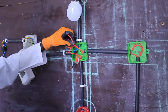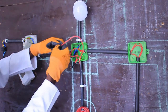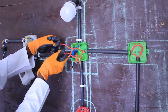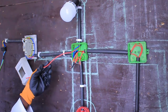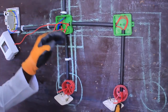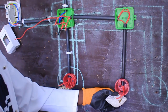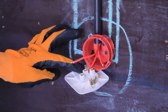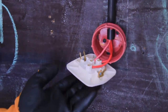What you have to do — as I already told you — in each direction there have to be three cables: ground for protection, phase, and neutral. As you can see in our junction box, there have to be three cables for each line, and you also mount the pipes accordingly. When you connect each cable to one another, you have to do it slowly. At each switch, there also have to be three cables: one for ground, and two for phase and neutral, as already seen in our first session.